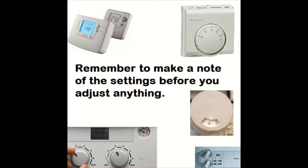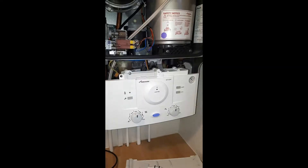Make sure you make a note of the temperature settings — or take a photo, which I find is easiest — including any programs you've changed or the hot water temperature, so you can set it back at the end when you've finished the service. This will avoid the customer calling you saying the hot water is too hot or too cold. Just stops any aggro.